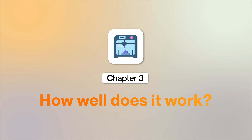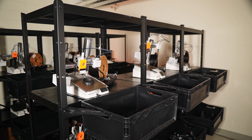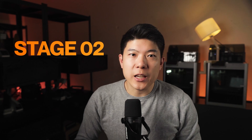But how well does it actually work? We have used this system for more than a year and have produced thousands of parts. But will it work with every part? No — remember, this is Stage 1, and with Stage 1 there are limitations. Big parts with high surface areas will not work well. That's why when we design our products, we either have to chamfer the bottom or purposely reduce the surface area. For all other parts, there is Stage 2, which will take care of parts that cannot be detached reliably with Stage 1.